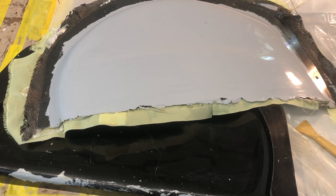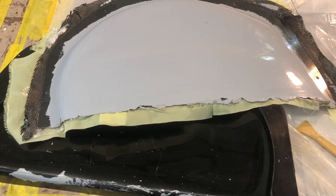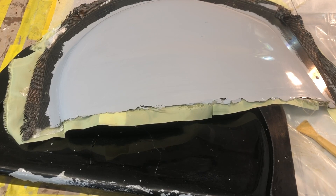I did this part with polyester resin from Lowe's, and the polyester primer is Ever Coat Feather Fill. I put peel ply on the back of it — that yellow Dacron material. It's a good way to make a good part.